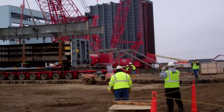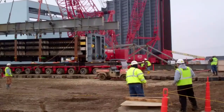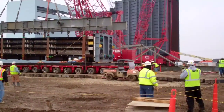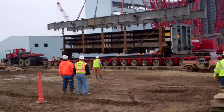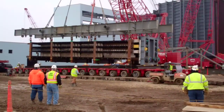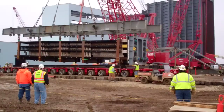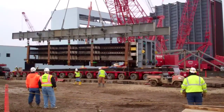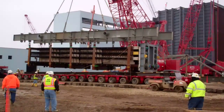Stepping forward from when we actually got the module in the yard — the module that Barnhart moved yesterday that we've seen in a previous clip — you can now see how this module is going to be placed in the strongback frame assembly. Looking around you can see model makers and safety people guarding the area so we don't have any unauthorized entrance. You can see how our third reheater, third and fourth superheater module is being picked using the vertical or horizontal lifting frame assembly, which is about 49,000 pounds, combined with the 138,000 pound module assembly.